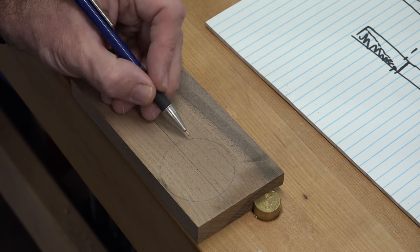Well, it's starting to look a little more like a coffee scoop, but I don't like this bulky handle. So we're gonna take this over to the oscillating drum sander. I'm gonna shape this handle here, and as well, I think I'm gonna get the trim router, and I'm gonna route a 1/8 inch round over all the way around the bottom of the scoop.